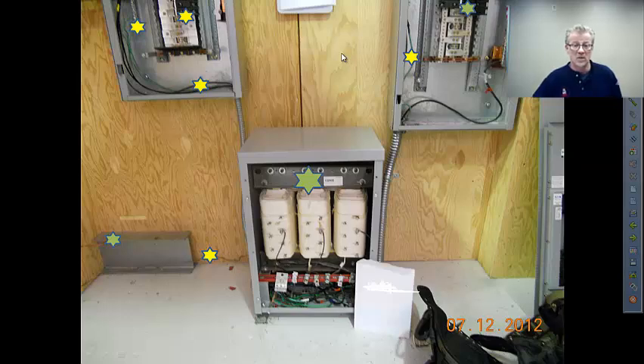The equipment grounding conductor and equipment bonding jumper on the supply side — and that can be tough for people to wrap their heads around — the supply side they're talking about is the supply side of the tap-rule-protected set of conductors off the secondary. Size it much like a service on the line side. The system bonding jumper might be in the panel board or in the transformer — follow specs, follow plans.